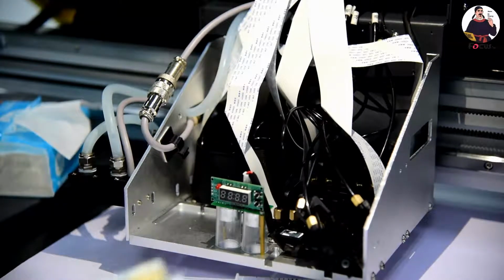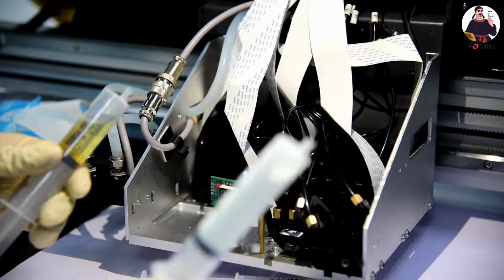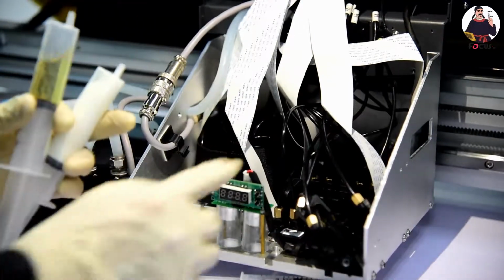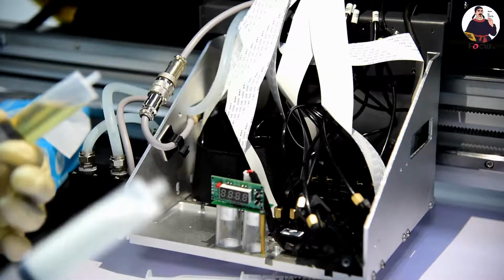And for all the ink we use, the first time we pour it, we cannot push it back to the damper or the ink tank, because the first time the ink tube inside may have lots of dust, so we must flush it away, not keep it for cycle use.